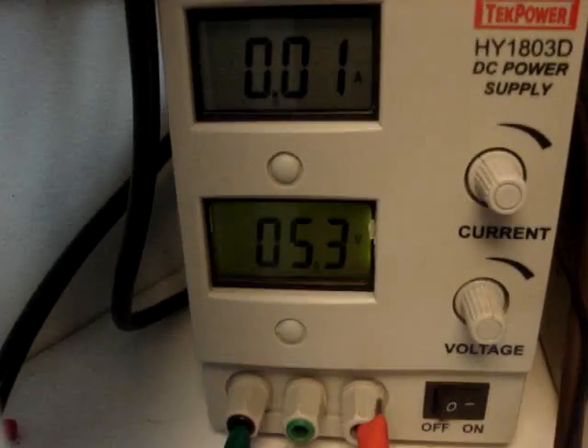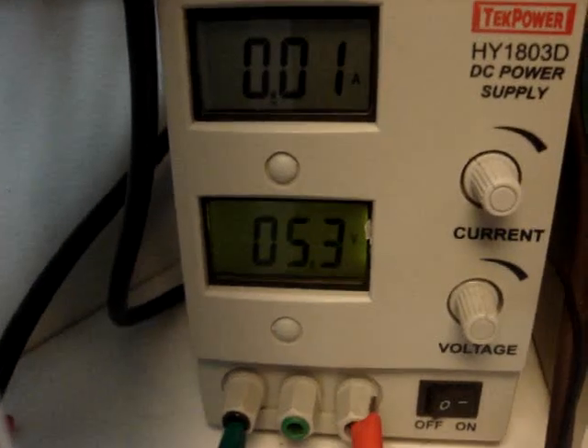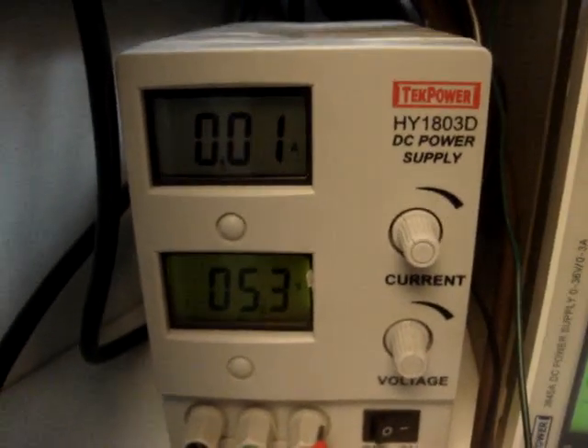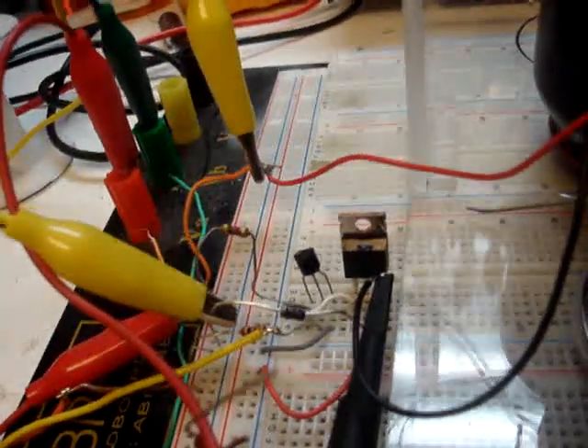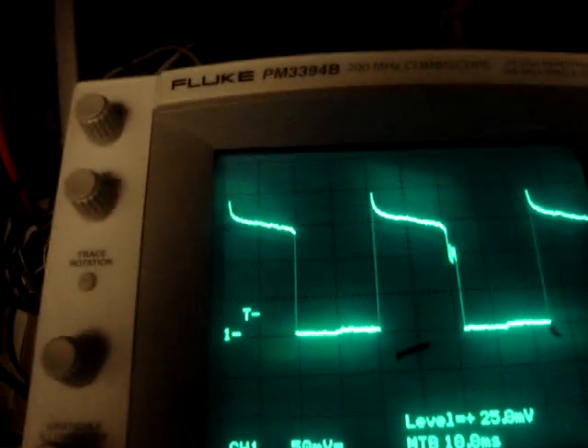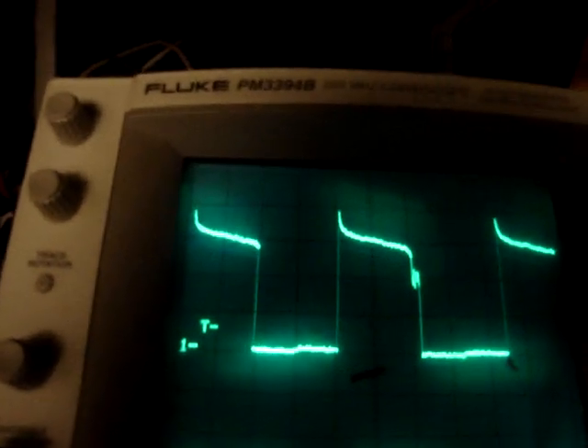The Hall effect has to have at least four volts to drive, and I'm just running it a little bit over five. The only voltage going through the coil is from that big FET there, from the one volt power supply. There is the waveform.